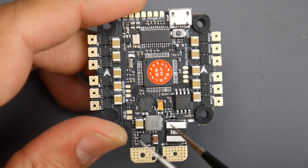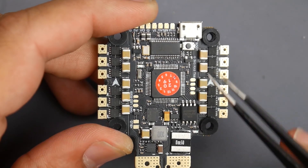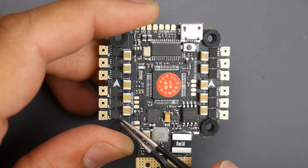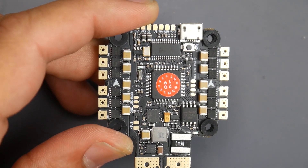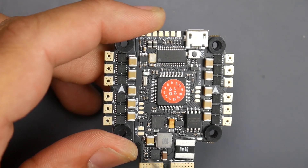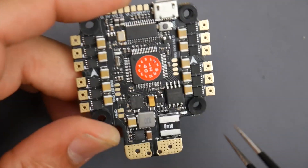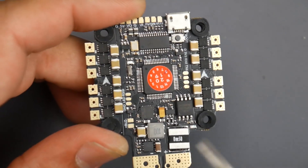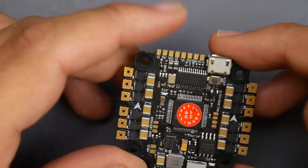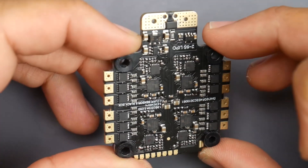We're rocking an STM32F405, so it's an F4 microcontroller. Wherever you install your receiver does matter — if you're using iBus, you can't connect it where you would connect your SBUS. For gyro, we're using an MPU6000, and it has a 5-volt 3-amp regulator on board. Your video transmitter will have to take battery voltage — there's no filtration for that, so keep that in mind. The ESCs are BLHeli_S, not BLHeli32.